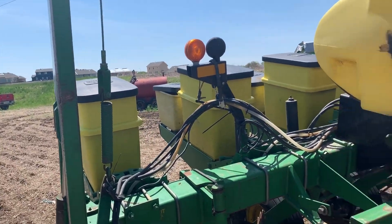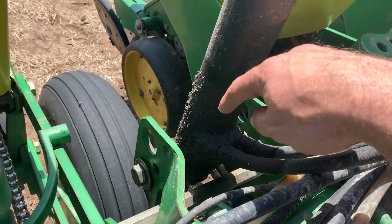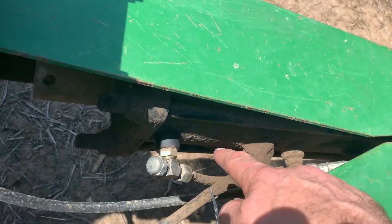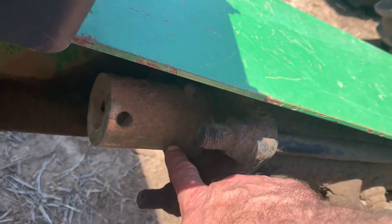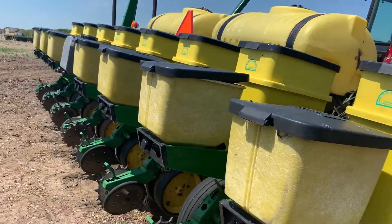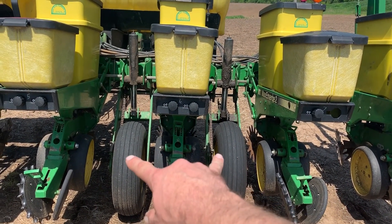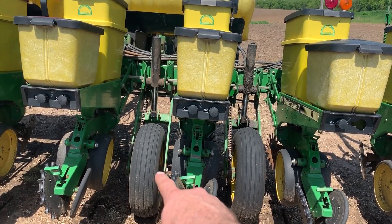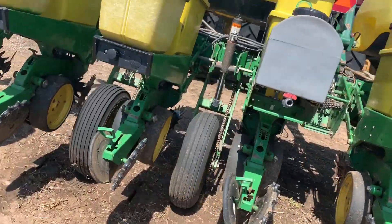If you can see, my machine's kind of tilting a little. What happens is - and there's another YouTuber talking about this, why his raise is so high - I've got some oil leaks on these hydraulic cylinders. What happens is it bleeds a little out. You've got your master cylinder down here and that controls both sides. What I've got to do is there's a spacer right here - you take that out, then you lower it and raise it and it'll correct it. Then you put the spacer back in. If you don't have the spacer in, all the tires are just locked solid all the way down, so if you go over a bump they don't flex. You want that, otherwise all the weight will end up on one tire and that one will be off the ground - and with all the weight on those two tires, that's how you pop rims and break things. I'll do a video on how I fix that at some point.